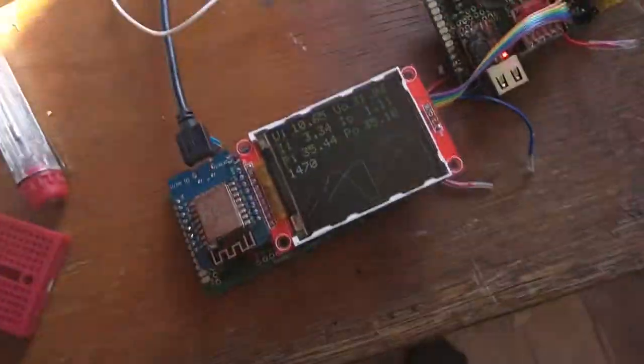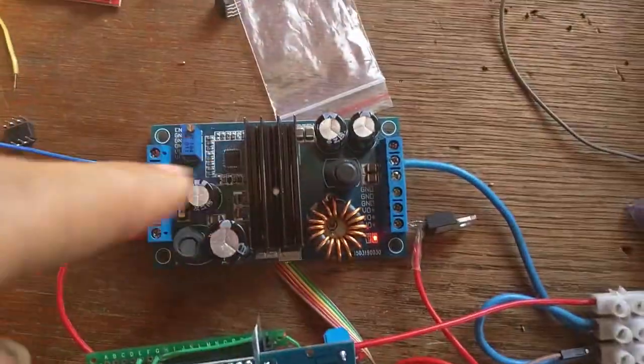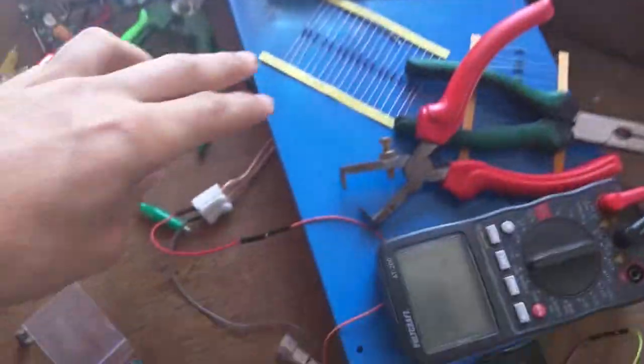This design is very efficient, quite cool, and very cheap. You can even stack them — right now this can make 14 amps, so you could charge a 24-volt battery with solar panels at up to 14 amps, about 300 watts. For about 11 euros you could buy more of these and have 700 or 900 watts.